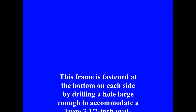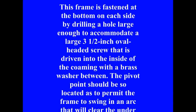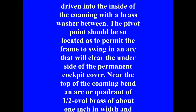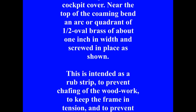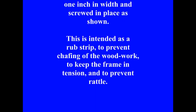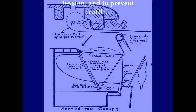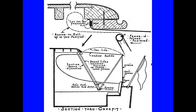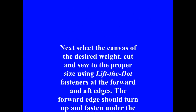To keep the awning canvas taut, use a quarter-inch bronze or stainless steel cable as shown on each side, each connected with a coil spring. The cable and spring are then connected to a small hook plate fastened to the back of the aft seat. A slight pull and it should readily become unhooked.